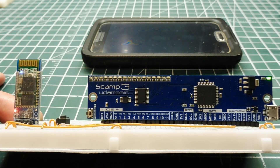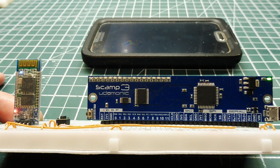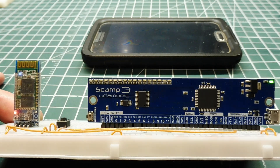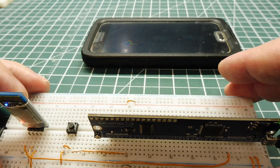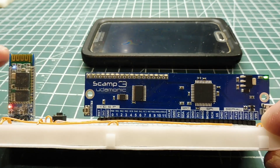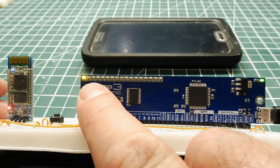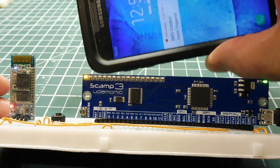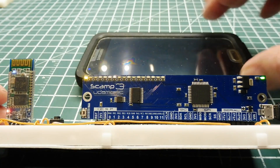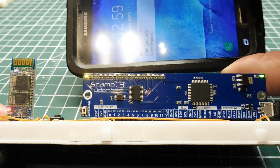The SMS alarm is sent to a number programmed into the microcontroller. Since I only have one cell phone for testing, I'm sending the text message to itself. I have a test button on my board — a little tactile button — and when I press it, it sends off the alarm. You can see the LED come on and the text message is received. It's set up to send a text message every 10 seconds.